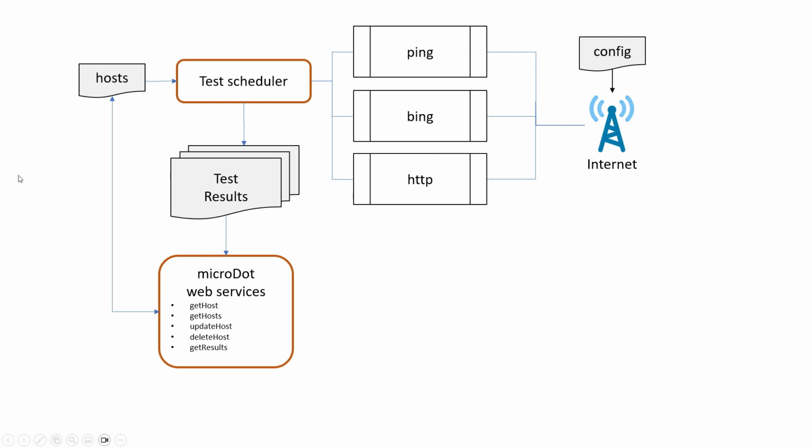The other half of this is really coming out of what I just did for the automated garden project. In that I had to set up a little website to provide web services, as well as have a scheduler where it could run timed things at certain times. For that, it's all in MicroPython. I used the microdot library for providing the web services, and I used a little asyncio routine that woke up and ran in the background to fire things off at certain times. So I'm going to do the same thing.